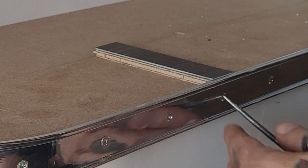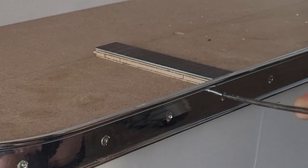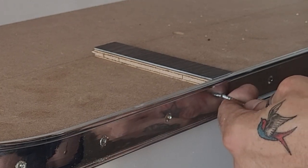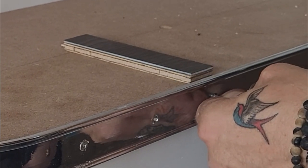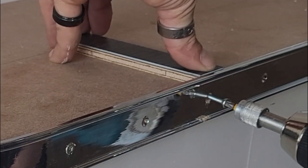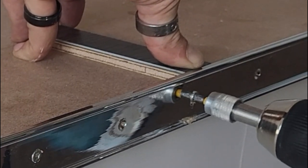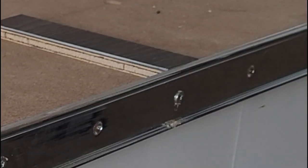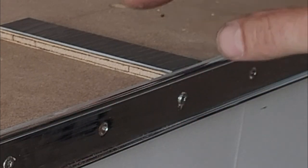Just for demonstration purposes, I'm going to come right to the top of the hole with a bradawl and just form a pre-drill. We'll get the screw right up into it and see if it works. What that does is the screw literally just pulls up a fraction.